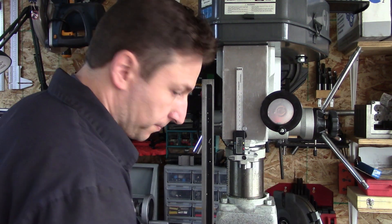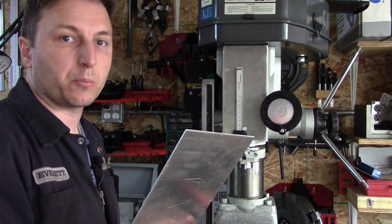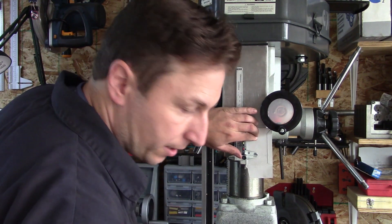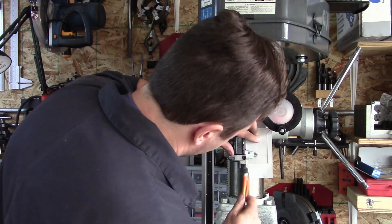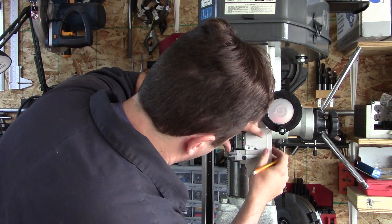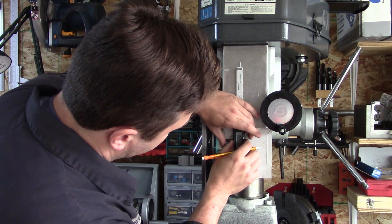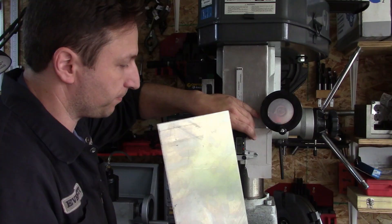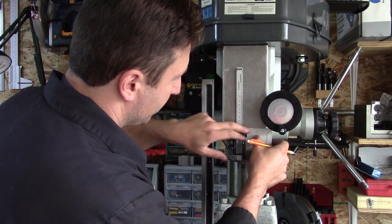For the bracket over here, I have a piece of slightly thicker aluminum plate — about an eighth of an inch. I'm just going to draw it on here. I can hear my son waking up from his nap, so I'll have to go attend to him. But that's the basic idea: I'll cut this out, transfer that shape, cut it out of the aluminum plate, and mount this little bracket to the front cover.